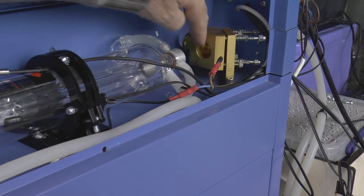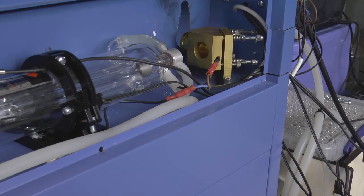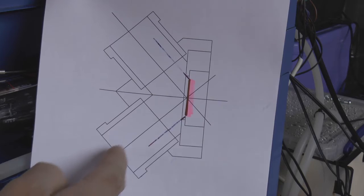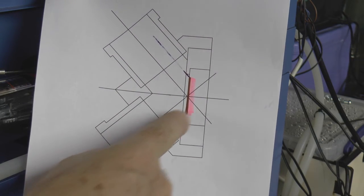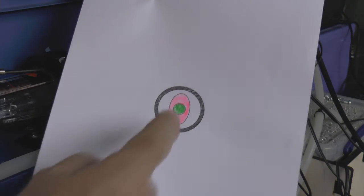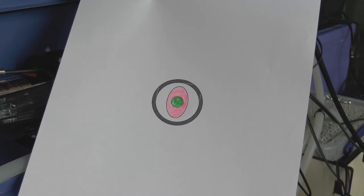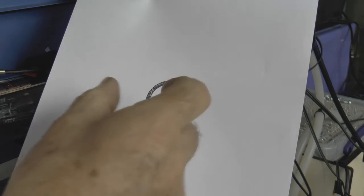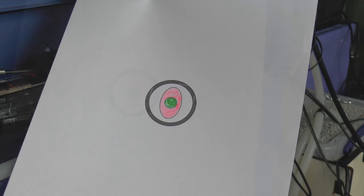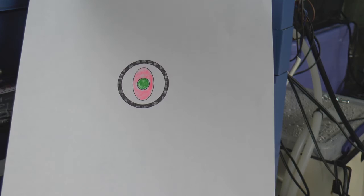When we start looking at the construction of that block, the laser beam goes in there, hits the mirror and comes out the other side. Although the mirror is mounted in a frame, the frame masks the mirror. The net result is that we have only got a 12mm wide mirror to aim at with the green laser, which is 6 or 7mm diameter. So in reality we've only got a very small margin of error, which you need in order to allow the laser beam to be steered onto the mirror during the setting procedure. It's because of this that I'm quite careful about how I've set up this tube to make sure that it fires at the centre of that mirror.